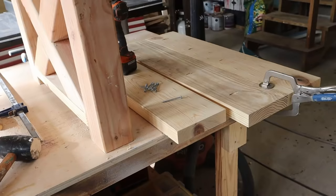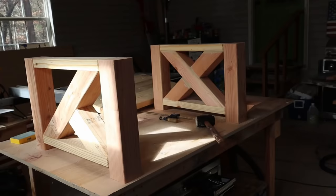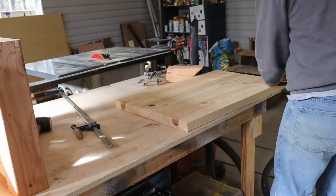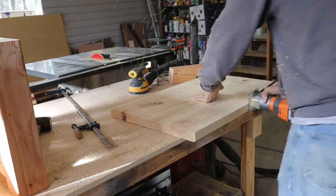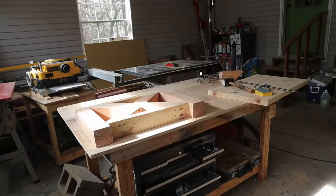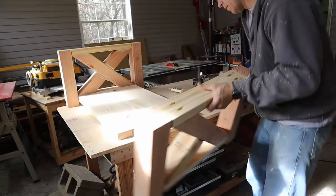This is going to be for the bottom. These are two by eights. I'm going to use the method where I joint with my table saw, connecting three of those together with pocket holes. I'm going to sand those down. I'll also use pocket holes on each end from the underneath side to connect both ends of the coffee table. I'm just using the pocket hole screw right into that two by four, making sure everything's nice and flat and flush.